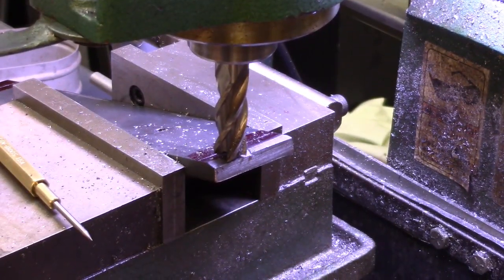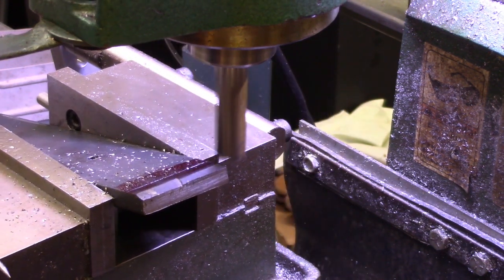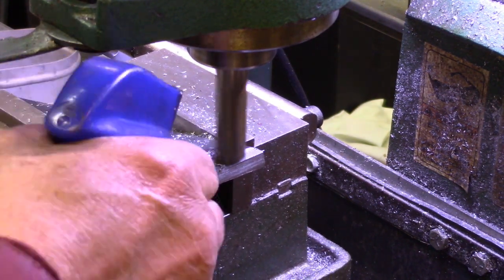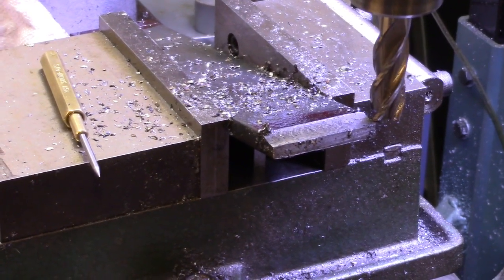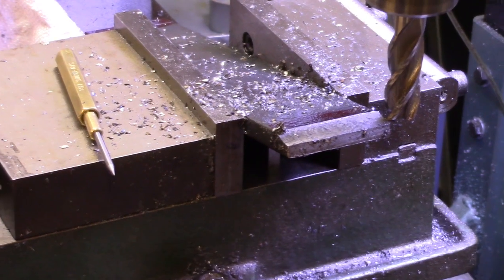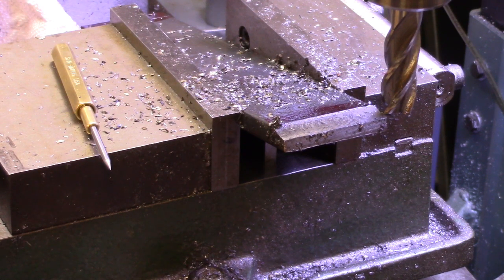I was right on both counts. The belt was slipping and my workpiece was not in there perfectly level, but it is now. All right, so I got it level for the last cut, which was good. About time. And I thought that was for the belt to slip off the end, but really, looking back at the drawings, that's for clearance for the wheels, the idler wheels that go on there.